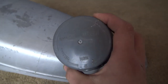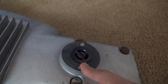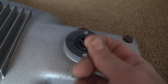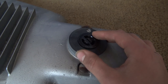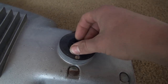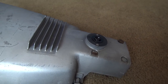This came with just one of those generic Fisher Pierce SunTech photocells that they love to use up here in Detroit — at least DTE's contractors use these. Our company uses black versions for our LED replacements. Here is the photocell socket — just a general Westinghouse Cooper style socket. Westinghouse's earlier versions had sockets that would plug in at the bottom; this one just has the wires coming straight out, and this design continued until now — they are still making Cooper lights with this design today.